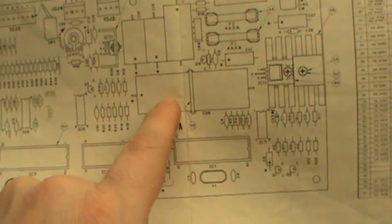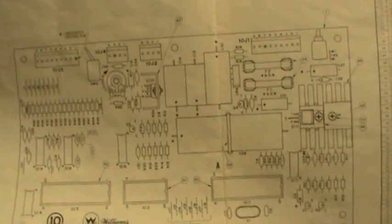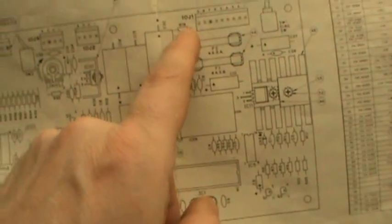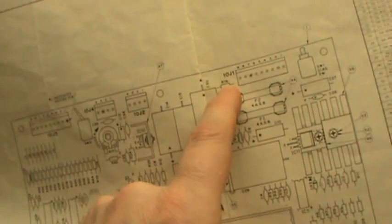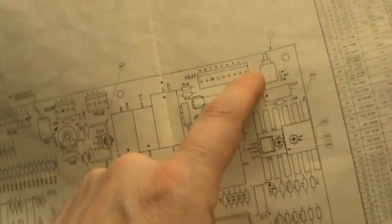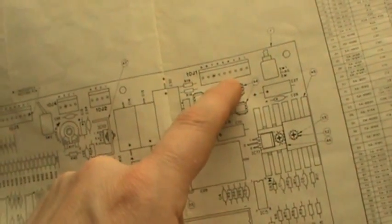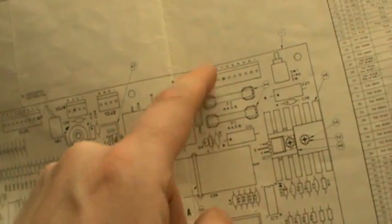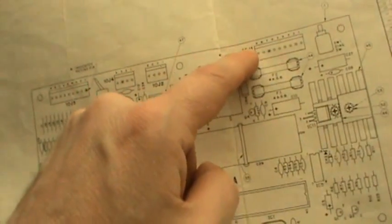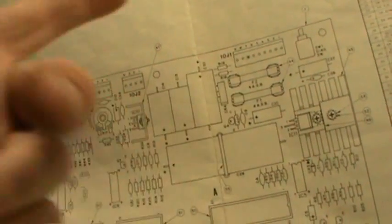This is actually a System 3 board — it might even be a System 4, I'm not really sure. It's got a 12,000 microfarad capacitor. One thing I noticed: the audio amplifier resistors are right next to the AC line on connector J10. Pin 1 is AC, pin 9 is AC — about 9.3 volt AC — and pin 5 is ground, center tapped from the transformer. I thought maybe the long traces coming out near the audio amplifier were picking up parasitic AC hum, acting like an antenna.